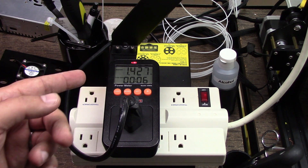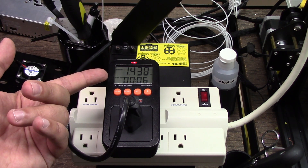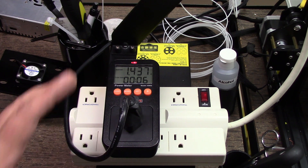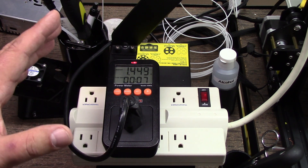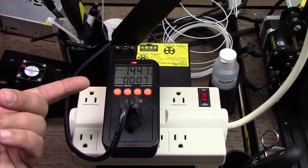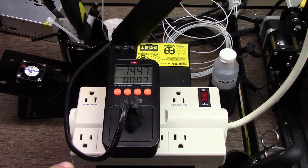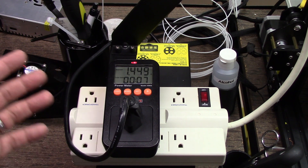What I'm going to do now is warm this up. I've activated the PLA bed profile, so the bed is going to attempt to heat to 70°C. You can already see the current jump up to basically about 1.43 amps. I'm doing this with a bit of an ulterior motive — I'm experimenting a lot with the Tronxy right now and doing some mods, so this meter is also going to help me with that. You'll see that in an upcoming episode. I wanted to show the different basic functions of the meter.